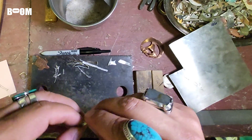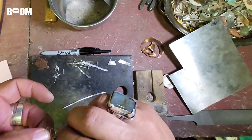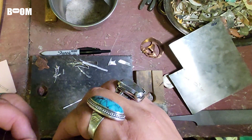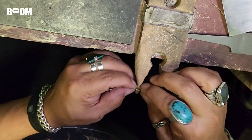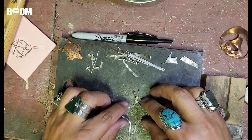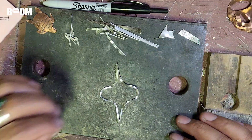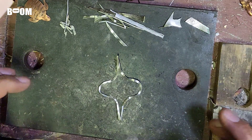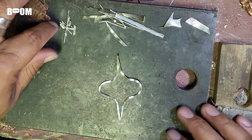We have both of these cut out of 26 gauge. You're probably thinking that's super thin — and it is very thin — but if you've seen my other videos, we're able to reinforce these thin pieces to something closer to 20 or 18 gauge. From this point on we're going over to the soldering block. The majority of the rest of the video is torch control, letting the silver melt into each other. This is a fusing operation — all fusing.